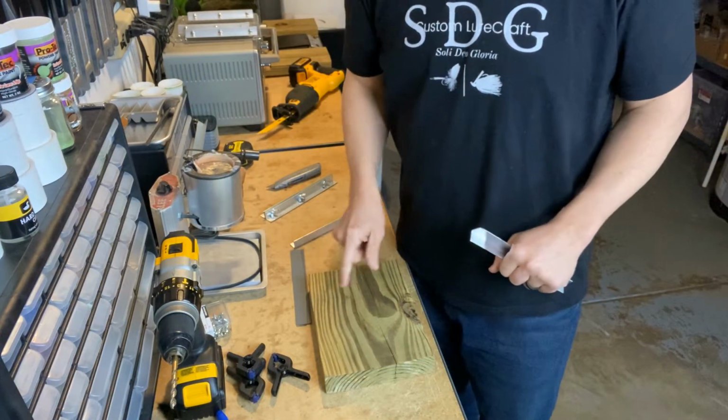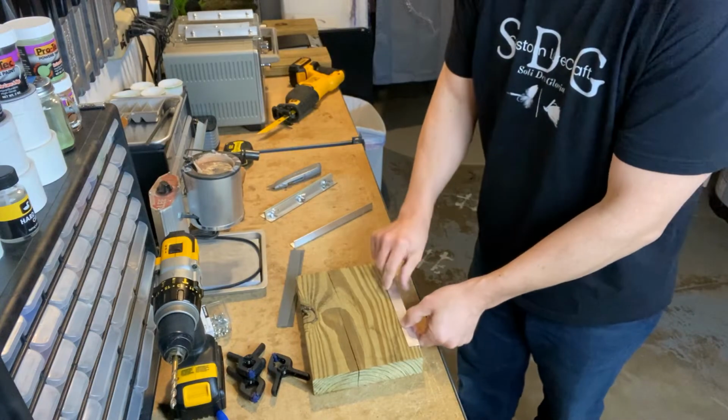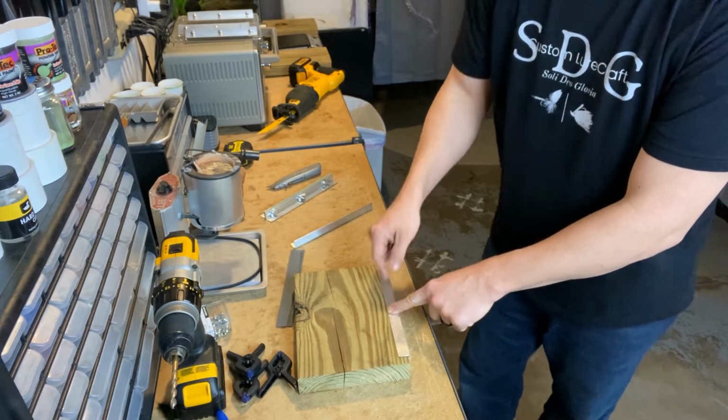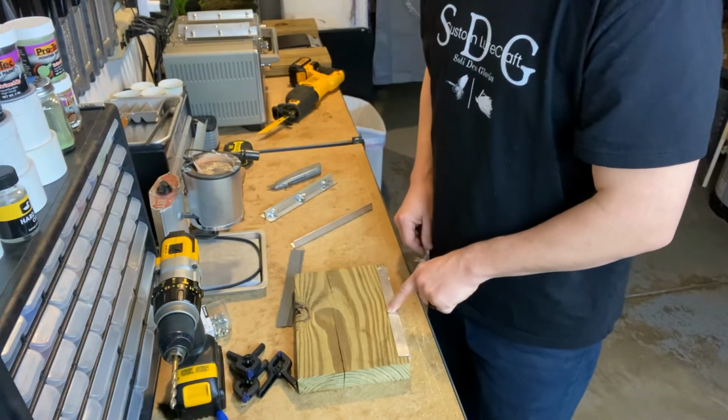This is also where this wood comes in really handy. Just like when I was outside cutting it, you can put it right on the edge and drill straight into the wood so that it doesn't bend the aluminum. It's real easy, thin stuff, easy to bend.